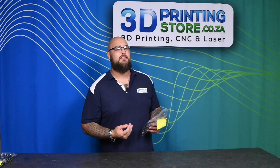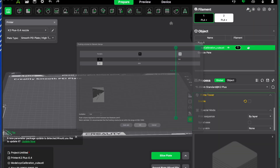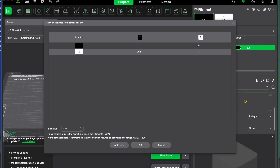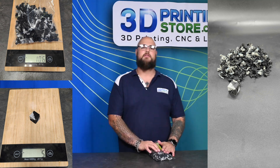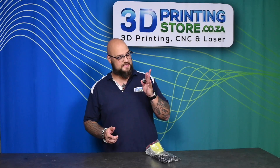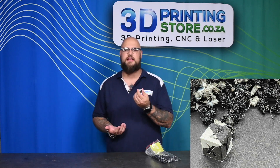I guess the only thing we can really do is make that purge a little bit higher. In our flush settings for the filament we can make this number higher — we're going to drastically increase it to try and get a real difference in our print. We've taken away the prime tower, upped the filament purge, and the print is looking better, but I'm still not really happy with that.